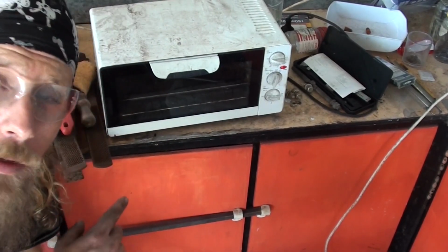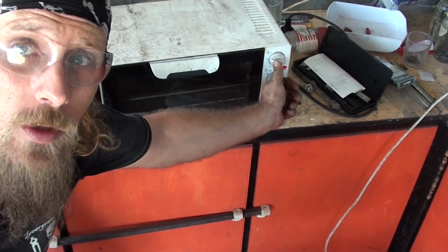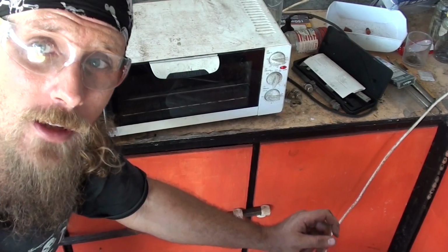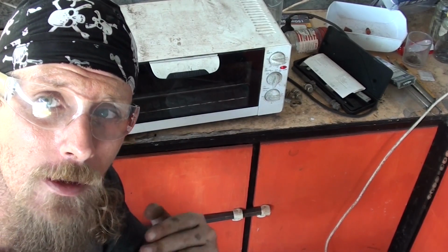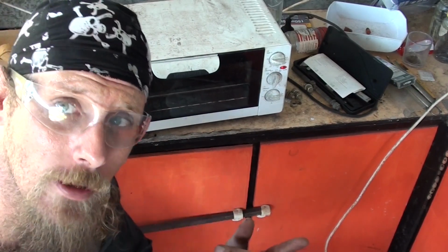Okay, so I'm doing this at the highest possible temperature on this because again we don't want it hard, we want it springy, and I'll be doing 3 2-hour cycles at 250 degrees Celsius or 482 degrees Fahrenheit, 480 degrees Fahrenheit. Again, it's not for hardness, it's for spring. Try and take that temper back a little bit further, which is why I'm doing 3 cycles as opposed to 2 and why the temperature is so high.